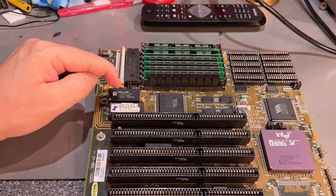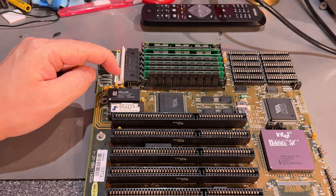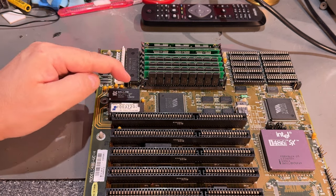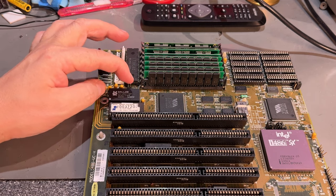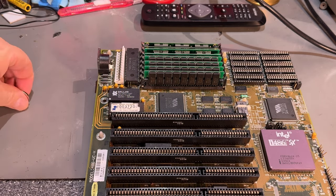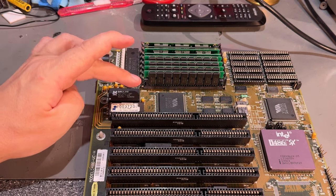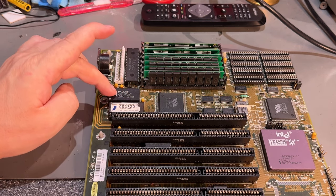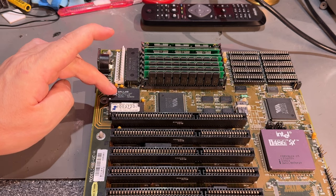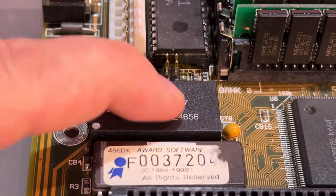You can of course buy this chip new — I found a couple on AliExpress and eBay, whether they're new or not I don't know — they're the same kind of chips. You can also buy replacement modules for this chip that contain the electronics and have a holder for a coin cell battery. But I don't want to wait for that, so I just want to modify this chip so that it can be used right now, and to do that you need to install an external battery. Here's a closer look at the chip — I just need to desolder it first and then we can do the little modification.